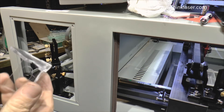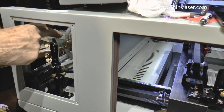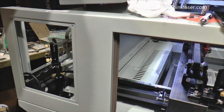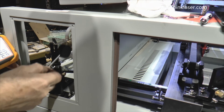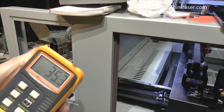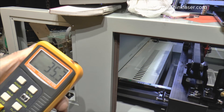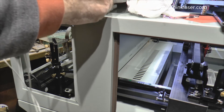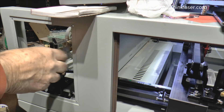This little device shows me approximately where the laser beam is coming out after it's bounced off the first mirror at 45 degrees, giving me a nice idea of the beam position. So we run the same test again but this time after the mirror. We're starting off at 10 degrees and we finish up at 35.3. It doesn't take a mathematical genius to work out the difference as being 25.3. So we've basically lost 5 watts across that mirror.